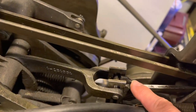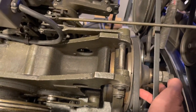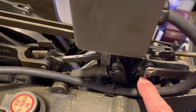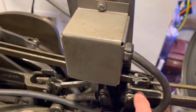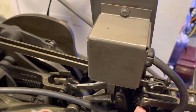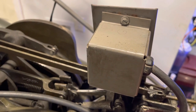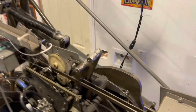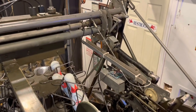Right here is the reset solenoid. This part here is what pushes down the clutch arm at the back of the gearbox. This is the clutch for the pin setter itself, and this is the clutch stop arm. You'll see that running here in a minute — the arm goes up and down, and when it's underneath, it stops the clutch arm, which stops the pin setter from cycling. I'll go ahead and turn it on here, run it through a few cycles, and you can see everything working.